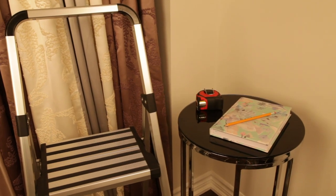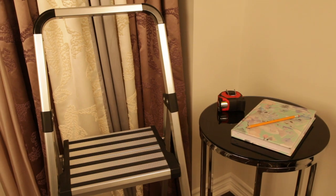When installing on the inside of the frame, it is important to make six measurements — because no window is perfect. Let me show you how to make the measurement. You need a metal tape measure, a notebook with a pencil, and a ladder.